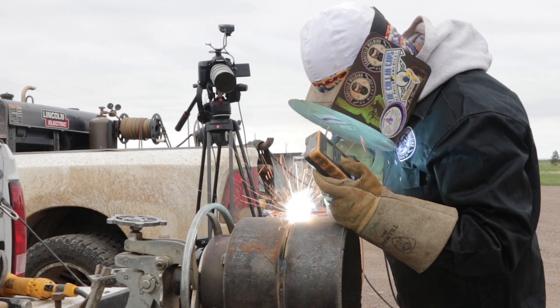We're on 30 on the remote. We're going to really want to stand that rod up, which is going to help it cut in there. There is high-low in this piece of pipe. This is where we soften that bevel — you can tell it's cutting in there real good. It's kind of wanting to hang to that piece closest to me. We're going to turn up five right there. We're putting a little pressure on the rod — not really jamming it in, but there is some pressure. We're going to turn up another five.